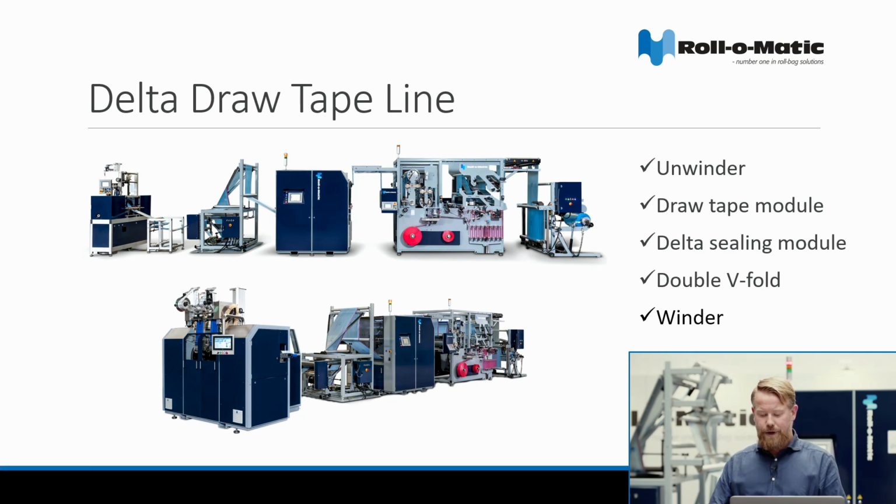Looking at the configuration, it includes an unwinder, the actual draw tape module where the hem is folded and the tape is inserted, the Delta sealing module, a double V folding unit, and a winder. On the winder side, we have different options. For instance, if you want to produce perforated rolls, you can use our high-speed winder series.